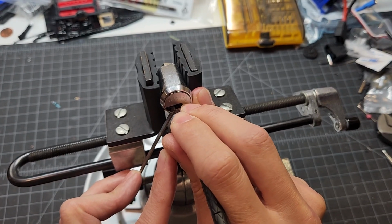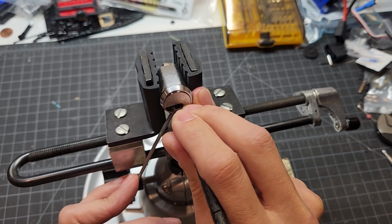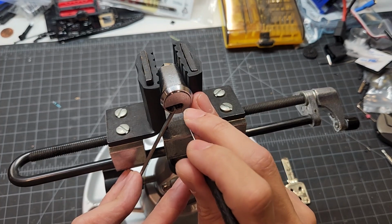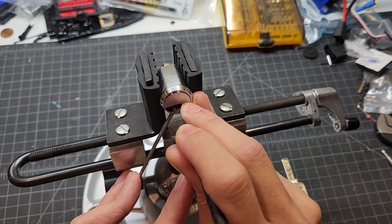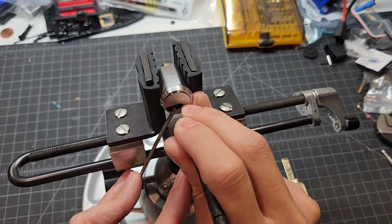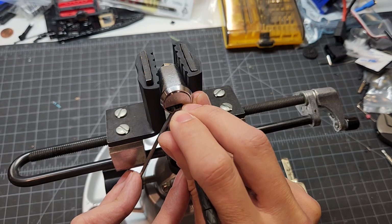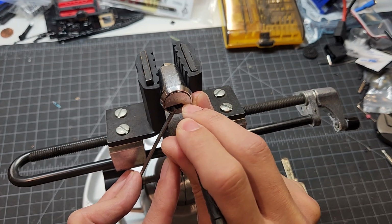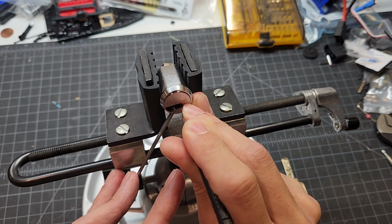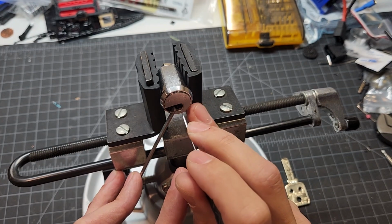Go back in. Okay, 5 feels like it's binding. Got a little click there, and I was able to sweep by it on the left side and got a little rotation on the core again. 1, 2, 3 feel loose. 4 is the one that seems to be bound, so let's see if we can move that up 1 notch. Okay, got a click. Okay, another core rotation.